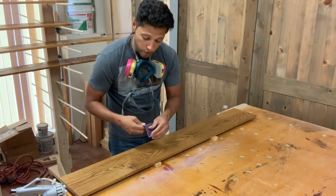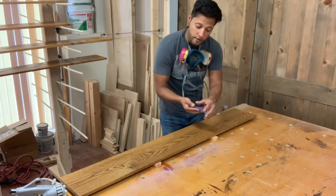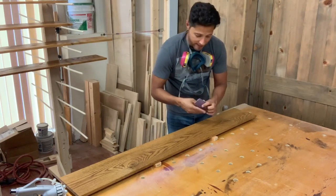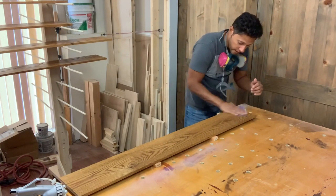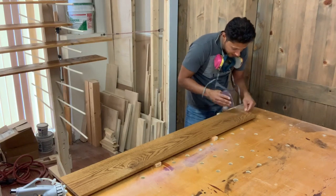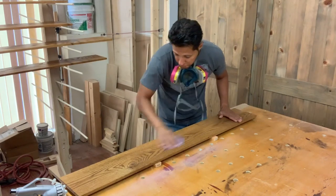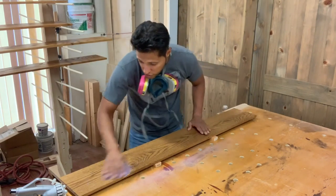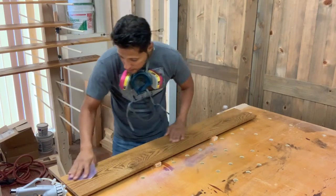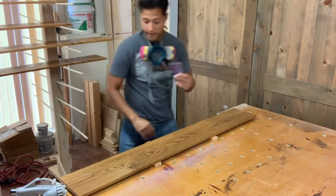You can see where the overspray went on the bench — that is still wet because I sprayed multiple pieces. That just goes to show you how long it takes to dry if you do a heavy wet mill coat. Being that the first coat on the piece was actually very light, it's completely dry. Now I'm going to take my 400 grit sandpaper and just lightly hand sand it — take off any little high spots or any bubbles. Break those real quick. This is just light pressure; I'm not pressing hard at all. This is just to knock down any of the finish.